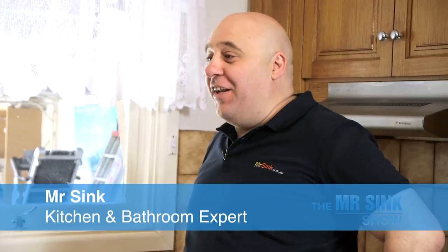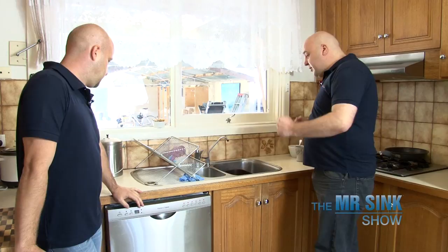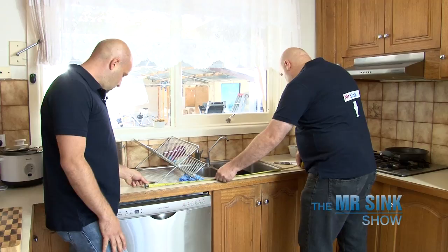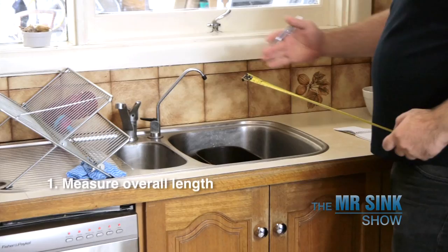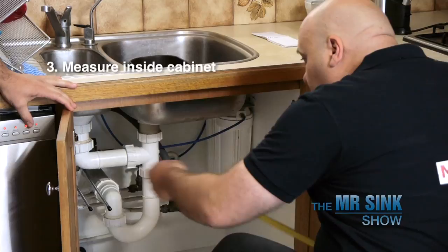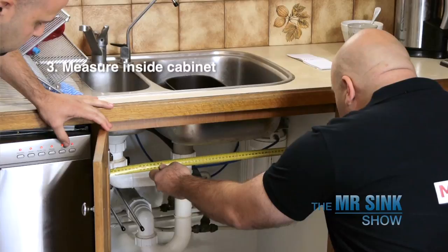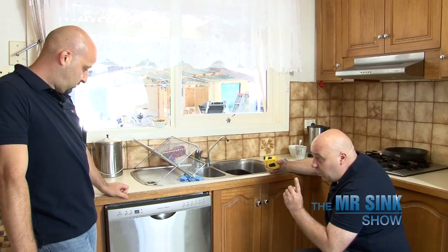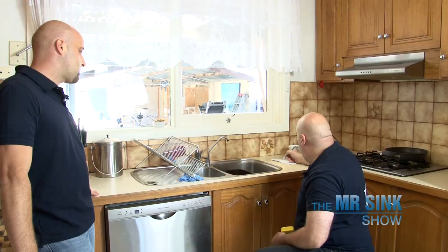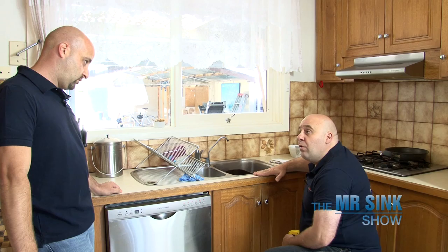So I'll ask Mr. Sink for his advice. Mr. Sink, do you think you can help? Yeah, I think I can help you. Okay, so we want to change the sink, make something a bit bigger. First thing we need to do is take some measurements — measure the sink total from left to right and from front to back. Next we need to measure how much room we have under here from left to right. What about the dishwasher? That may be a problem too, so we need to take the measurement from the edge of the sink to the edge of the dishwasher. Now that we have all the measurements, we can go shopping. Let's go.